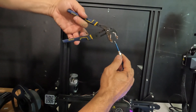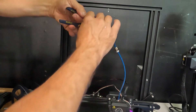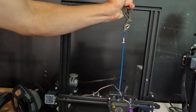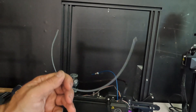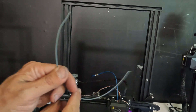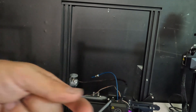Now that it's hot, grab the filament with something strong and pull straight up, gently and slowly. There it goes. Typically it'll pull out more smoothly, but as you can see it let go of the nozzle — it popped right out.